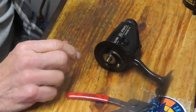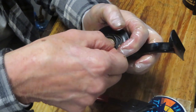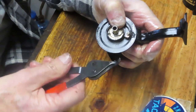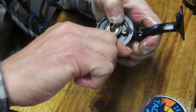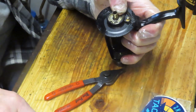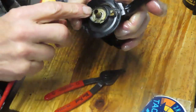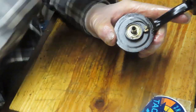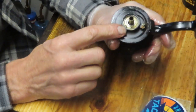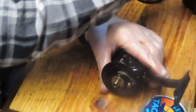When reinstalling the snap ring, anchor one side and hold it with your finger — these things shoot during install. Minimize the chance of losing it by holding your finger over the top. Make sure it snaps into place and is running in the groove. Give it a turn to make sure it's spinning nicely and easily.